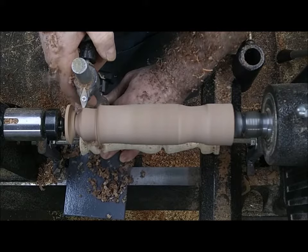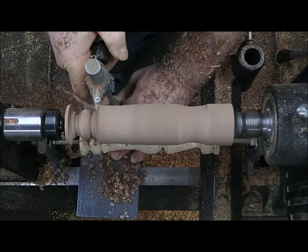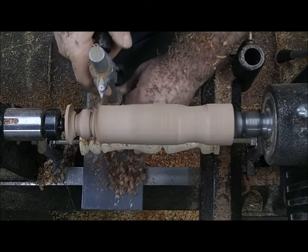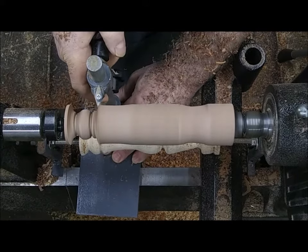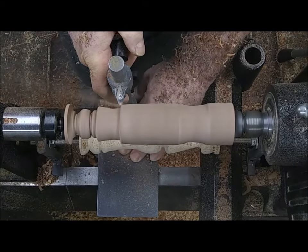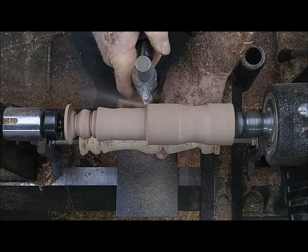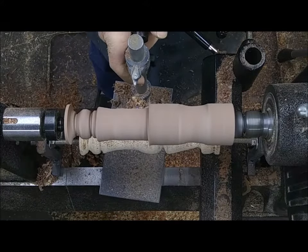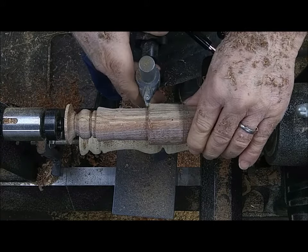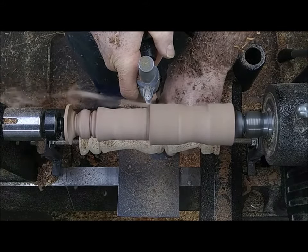You know I can. I'm going to follow that master down there. Yeah. Walnut cuts nice. Give that little puff, keep that cleared out. I'm going to take two passes here. I could probably do this in one pass, get everything smoking and carrying on, but I'm doing pretty good right now. Look, I'm probably getting quarter inch front to back, so maybe a little less than a half inch there. I can live with that.